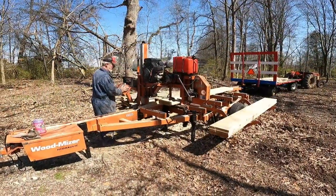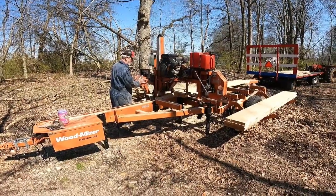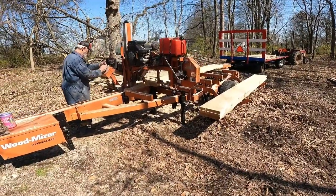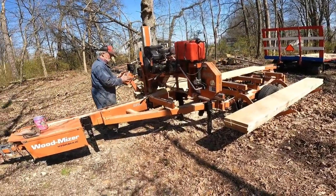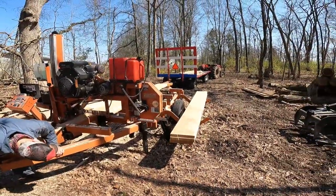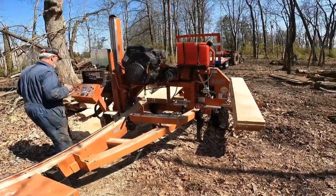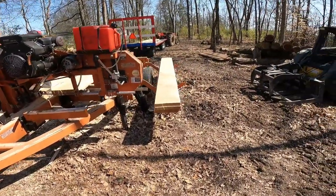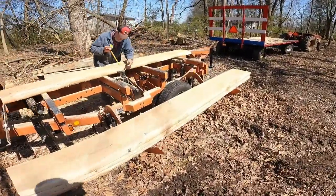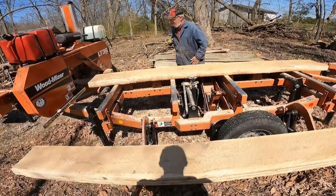We have come to the wood cutting portion of this video. Yes, the drawings for the floor say to put 2x6s on top of the concrete block. And we'll see the floor laying out here shortly. But right now, we're cutting our 2x6s. And I'm not overly worried about the type of wood. This is pin oak we're cutting. There's some ash in the stack. We're finding out just how good we can mill a log into the exact number of boards.